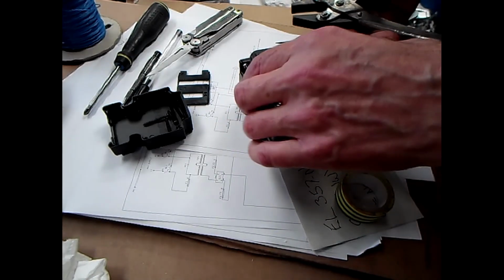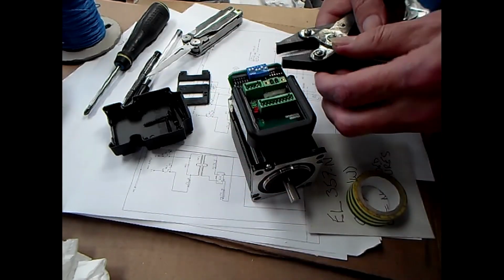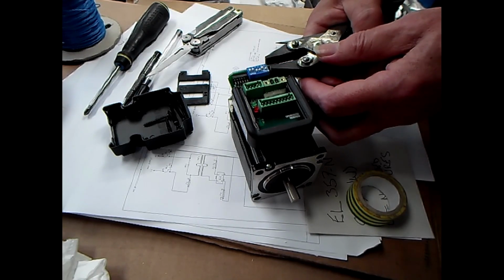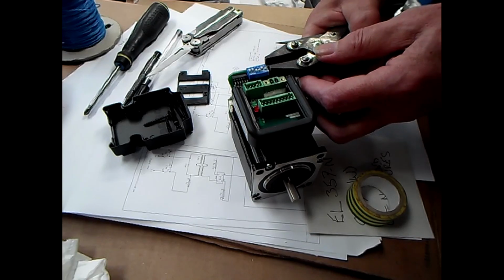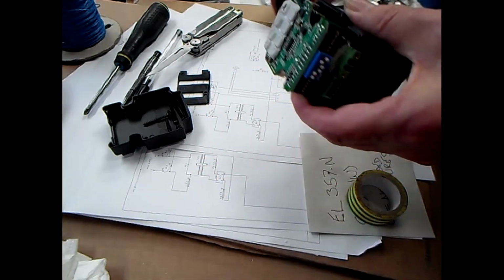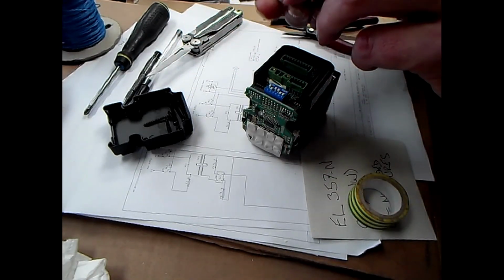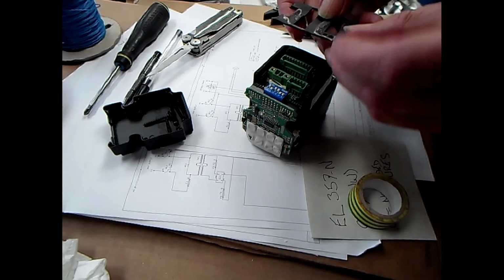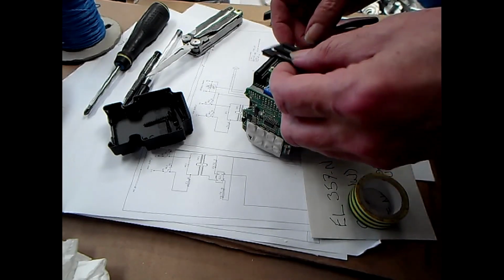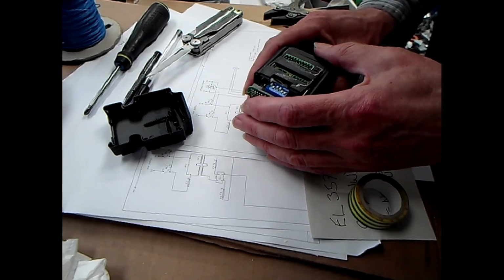The MCLR pin on the PIC is wired up and enabled. The brownout configuration bit is also enabled. With a fresh start, the chip input-output parameters, etc. are set and cleared as desired. That's as I programmed them to be. The RAM is cleared, or individual bits are set if I so desire. A number of free, unneeded RAM addresses are now written with a specific value which I give them.